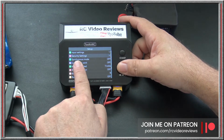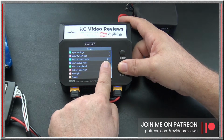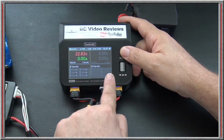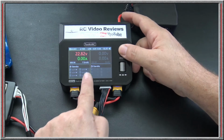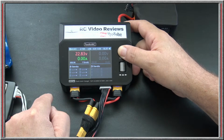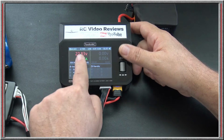Okay, so here's the option for synchronous mode. Notice that's off right now. So I'm going to change that to on by turning the wheel to on. And now we'll hit return, and you can see that now this channel's grayed out. No longer can I work in there. In fact, if I press the channel button, it doesn't do anything. Maybe if I long press, it'll read the current or the resistance. Yeah, there we go. So there's our channel now.